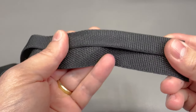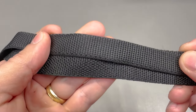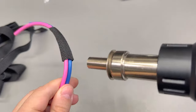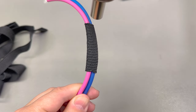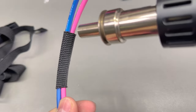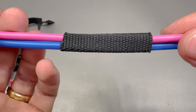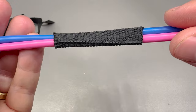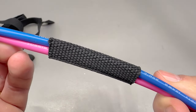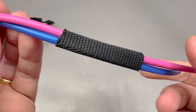If you want a professional braided sleeving finish, this will get the job done, but here are a few things to be aware of. This stuff is more expensive — not a fortune, but considerably more than standard heat shrink tubing. It's also thicker, so expect a stiffer and thicker final assembly. Be careful when applying heat — don't go full blast as it might melt and wrinkle it. I tested with my hot air station at 200 degrees and it works nicely, slowly shrinking. There is also a visible seam where the tube has been joined. It does look nice and professional once done, so it's well worth considering.